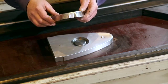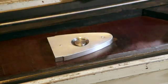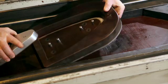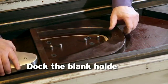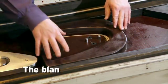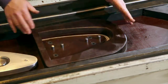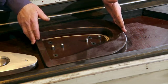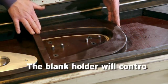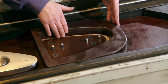So to control the blank here, we have to have a blank holder. What I will do now is adopt a blank holder to the tool itself. Here you can see the blank holder — the blank holder is hardwood, and it's perfect just for aluminum. I will control the blank when it falls down into the gutter between the tool and the blank holder.